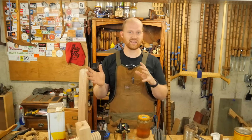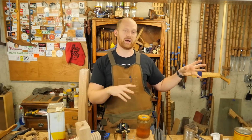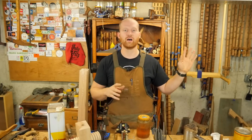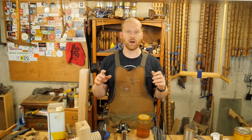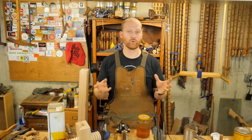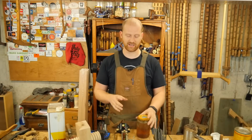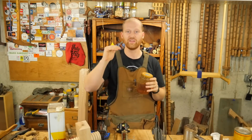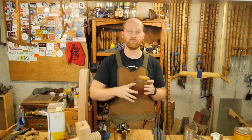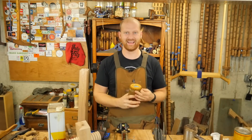There were many ways of doing this in the past, and there were chemicals they used to use in days gone by that were extremely dangerous. The new chemicals are very, very mild in comparison. But you can also do it through a boiling process. Now this is where things get extremely dangerous, because linseed oil has a flash point. In other words, if you bring the temperature up to a certain degree, it will suddenly combust, and flames will ensue, and that is not a happy thing.